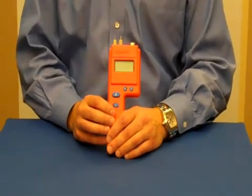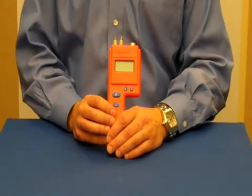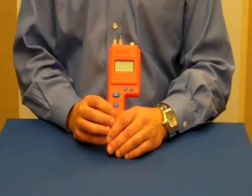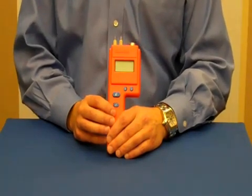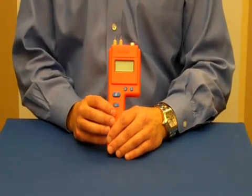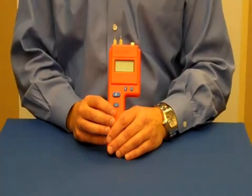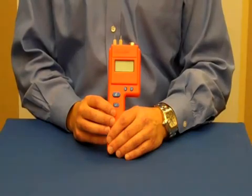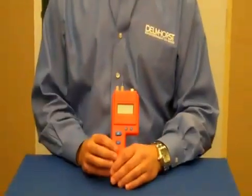Finally, the J2000 will store up to 100 readings, giving you a summary of the number of readings stored, the average of those readings, and the highest reading. Having the average and the highest reading is important information when you're taking many moisture tests, because the closer the average and the highest are to each other, the more uniform the wood is. The J2000 is an extremely useful tool for woodworkers and craftsmen and comes with the support of an experienced service team solely focused on customer satisfaction.